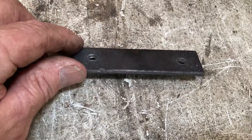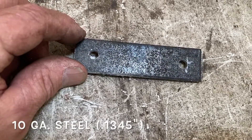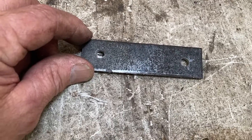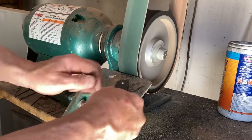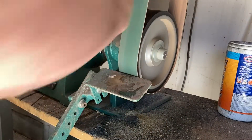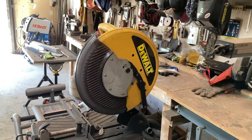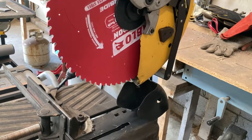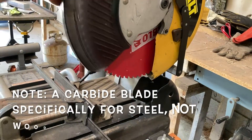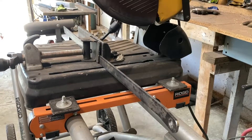I've just fabricated a little mounting bracket from 10-gauge steel — that's 0.1345 inches — four inches by one inch, with a couple of quarter-inch-plus holes for mounting bolts. Now I want to clean these edges up. Another weapon of choice: my DeWalt cutoff saw for steel, obviously with a carbide blade. These last pretty good if you don't abuse them. Some people call these things chop boxes — you just want to ease your way through the material.